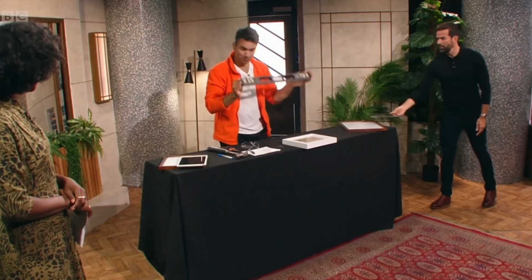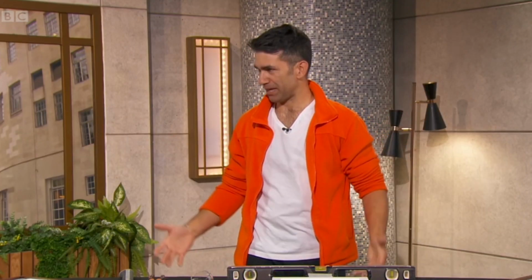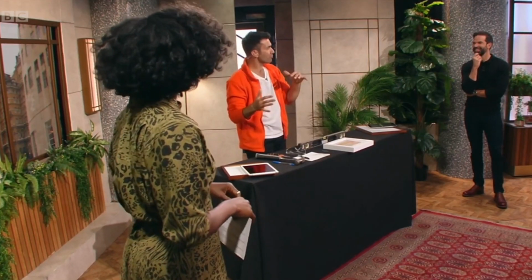My next big top tip is sometimes just ignore the spirit level. Ignore the app, ignore the spirit level. Because if you're putting a picture up on a wall, say, above your mantelpiece, you've used your spirit level, the picture looks beautiful, but the mantelpiece is slightly off. Because it's a Victorian property, and over time things move, your subconscious brain will look at it and always believe the mantelpiece, not your picture. So go off the mantelpiece, go off the surroundings rather than the spirit level. Yeah, I know all about wonky walls.